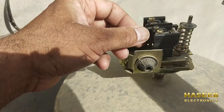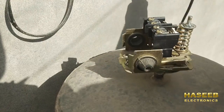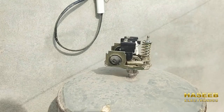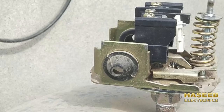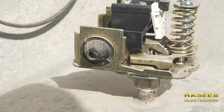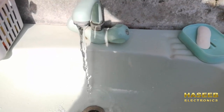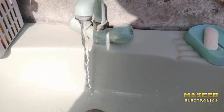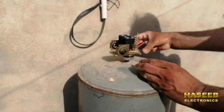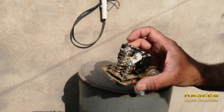We have to remove the outer two wires and the load — the water pump. So I remove these two wires and pull them out. This wire is for the water pump. Now this pressure switch is electrically disconnected and now we have to reduce the pressure, because this time it is pressurized. Lower the pressure by opening the water tap so this reservoir must be empty — we have to depressurize this water reservoir. Now the water pressure has been released and the tank is depressurized. We can use an adjustable wrench to open it, rotate it counterclockwise. So the pressure switch is removed.